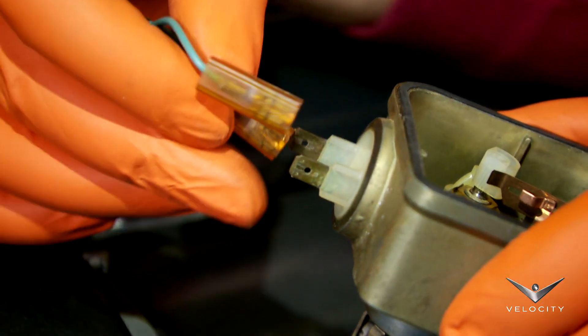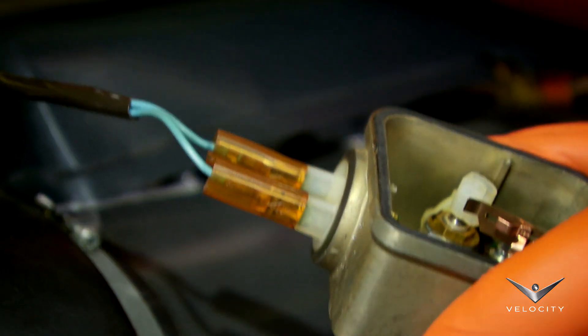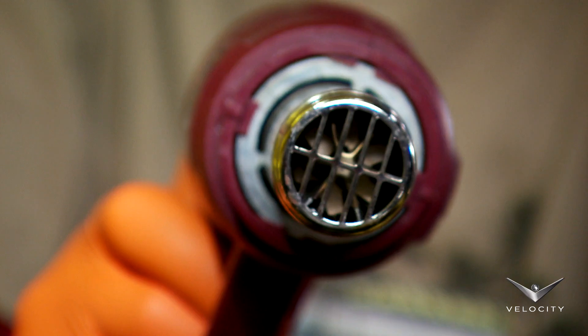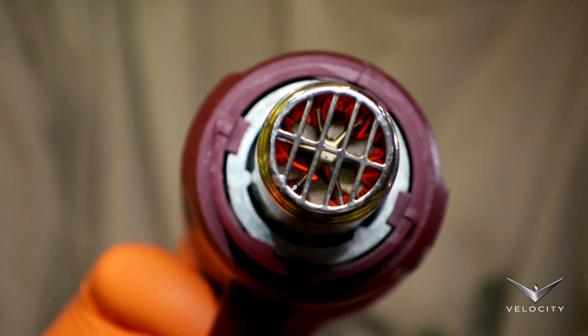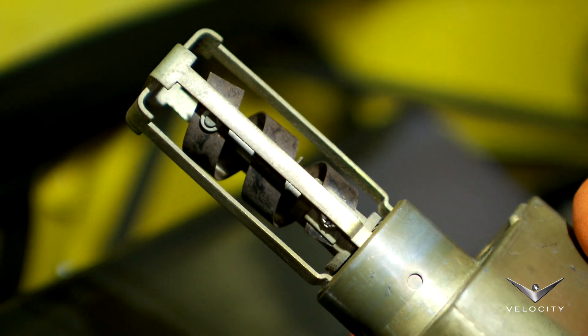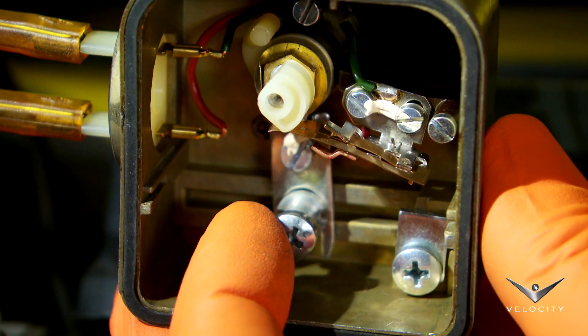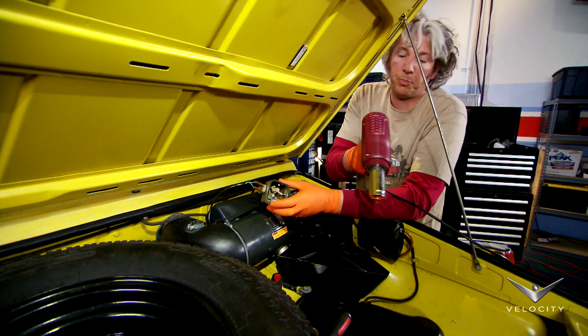So now, when I connect our wires, it should now go on. Just to show that it works, I'm going to turn on the heater and warm up the bimetallic strip. You can see it actually shrinks slightly because it now thinks it's up to temperature. But if I wanted a bit more heat in the cab, I'd then pull our little button for the temperature control out, which moves the Bowden cable, which moves this arm. So this works perfectly as you'd expect.